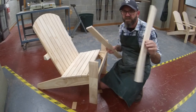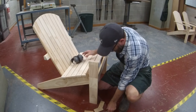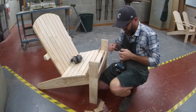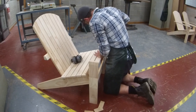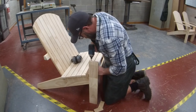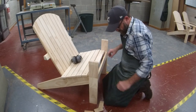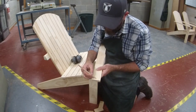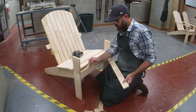I still haven't countersunk these because I need to check something. For these ones, because they're so close to the arms, you might find it easy to use a longer Phillips head attachment. Again, 6mm. Now, why I don't want you to put the countersinks in this yet is, if we chucked them where we were going to, halfway, there's a good chance when it goes exactly where it needs to be, it's going to miss this front rail anyway.